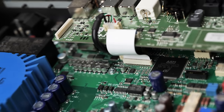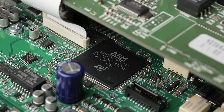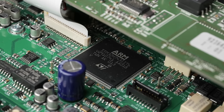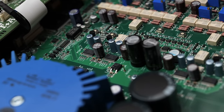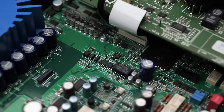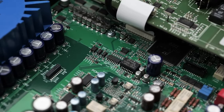We can see all the digital circuitry tucked up against the inputs, including a fairly large ARM microprocessor which also serves as the USB receiver — this is not using an XMOS chip, for example. The actual DACs are over here, and in between them and the digital section you can see a few components including an isolation chip which provides the galvanic isolation. This means that, in theory, no noise can get from the digital section to the analog section.